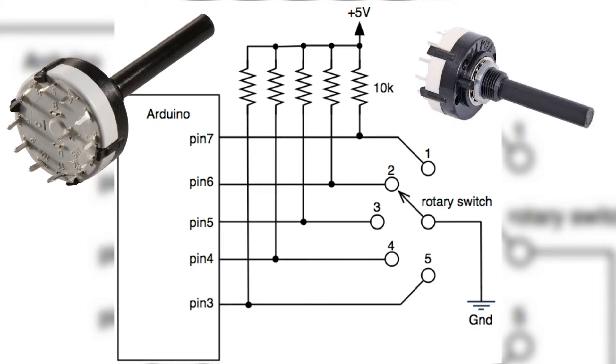This becomes quite frustrating when you're using a rotary switch, which may have from 5 all the way up to 12 different pins that come off the one rotary switch, because you have to use a single pin going into your Arduino. If you're using an Arduino Uno with a 12-pin rotary switch, then there's 12 digital pins that have disappeared just for that one rotary switch. I did one project where I was actually using four rotary switches that were all 12 pins each — so that's 48 pins just for rotary switches.